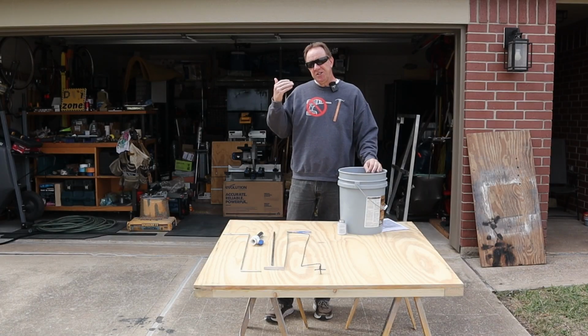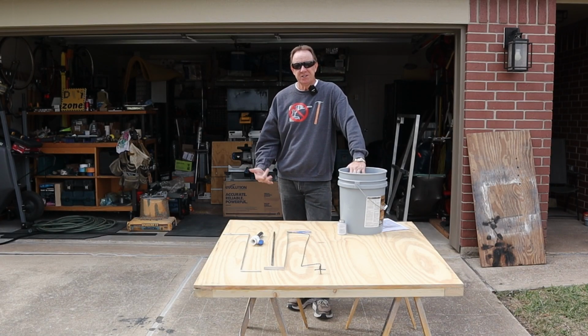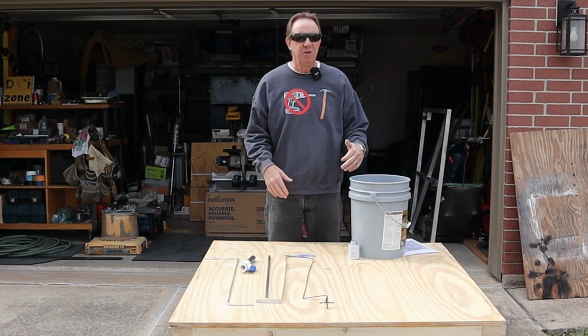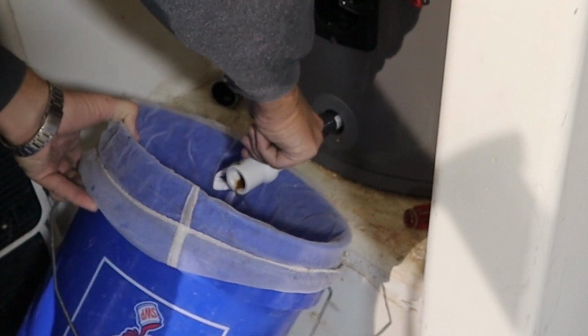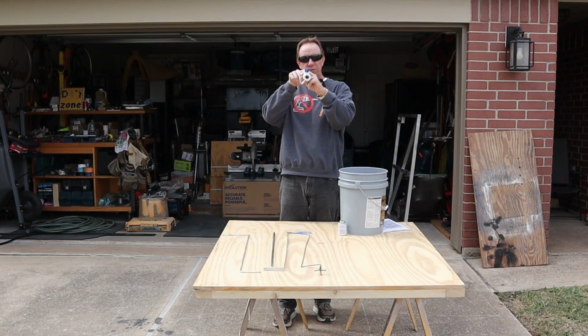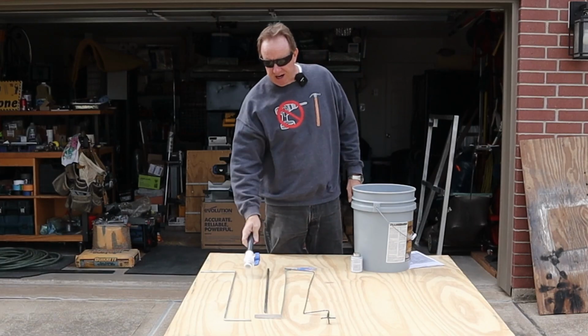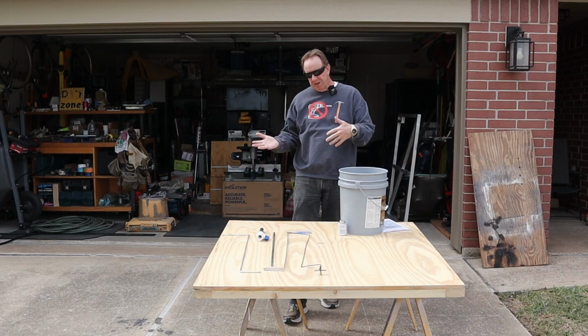And two, since I couldn't show you, but the sediment was all the way up to that bottom element, it needed to be flushed, which means some of you may also be saying, well, you could have just flushed it from the valve. Well, watch the beginning of the video, I had no water coming through it, because I don't have a valve that's got a straight open hole through it from which that grunge could be flushed out.